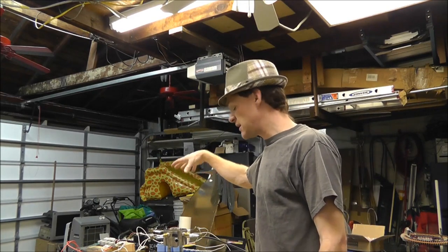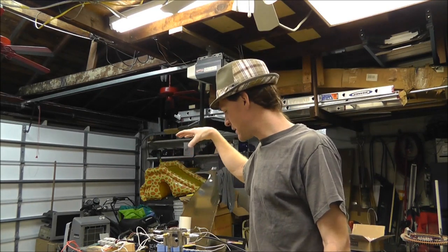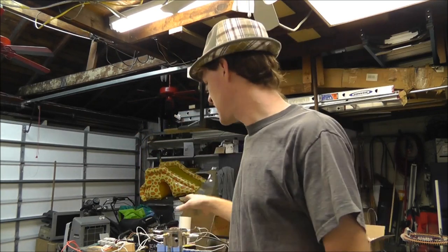I don't know if I mentioned this, so I'll mention it again. Somebody asked me, what does this look like in air? I think I did answer this. Whenever you fire this thing in regular air, it actually is more power. It pushes the piston harder. But the thing is that you have chemical processes going on, and the gas smells real bad, and you burn up your electrodes really quickly, and all sorts of weird stuff happens.